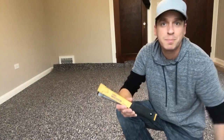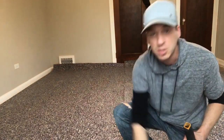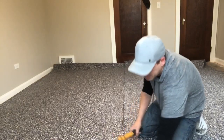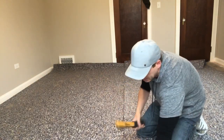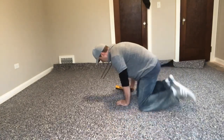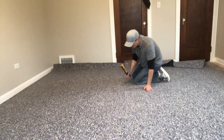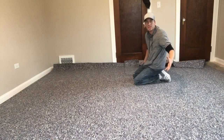If you have one of these pad staplers — some roofers use them for the felt paper — either one works. If you don't have that option, you could also use duct tape to tape your seams and tape it to the texture. Get some staples in your stapler and we're just going to staple this down in a zig-zag pattern, holding the seam together so when we unroll the carpet it doesn't shift the pad or have it unroll on us. As simple as that, we're going to go all the way down the whole length, then do the perimeter and trim it in.